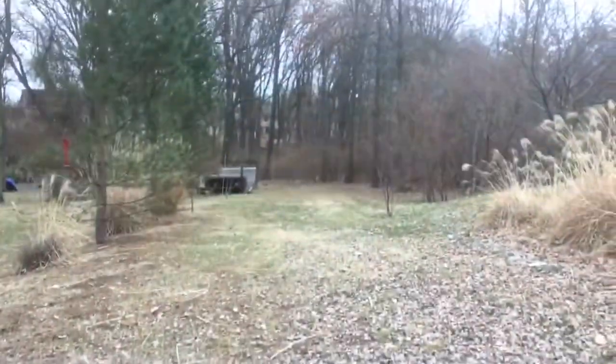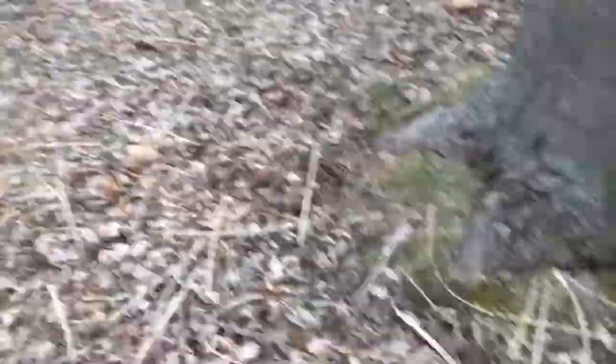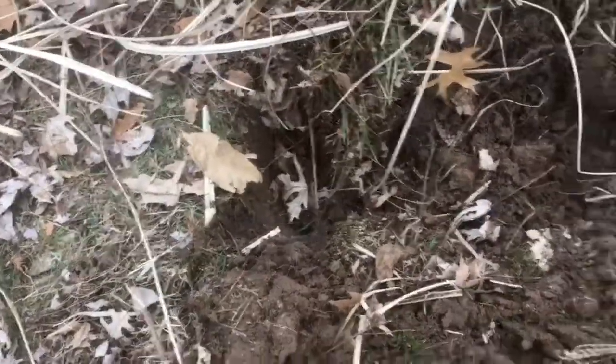You can hear it skip right there — that's right when it is over the top of the wire. Just scan back and forth in different sections of your yard and you can pinpoint exactly where the break is — where the sound stops coming from both angles.